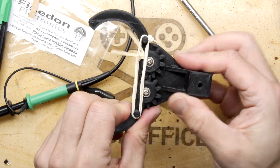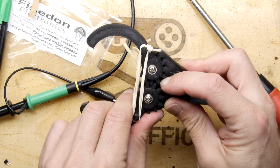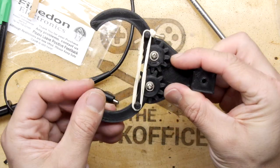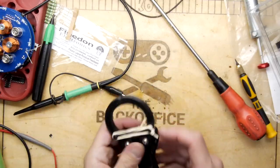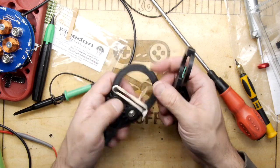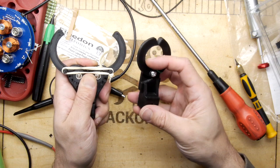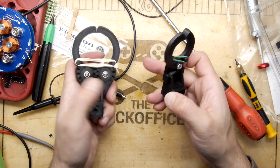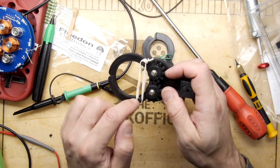Looking at how far it opens — you don't really want it to go any further than a certain point for it to automatically shut. I'm thinking you could put a feature here to stop that — literally a keyway that hits a stop, so it just doesn't go any further. With both of these designs there's a very neat opportunity to add a servo and make these actual robotic arm type end effectors, which I think would be pretty cool. The spur gear version has a very light throw — perfect for one of those little 9-gram servos. The other one would need a bigger servo, but you could have the motor incorporated directly into the design.